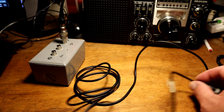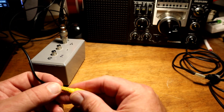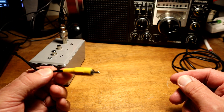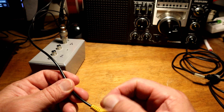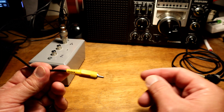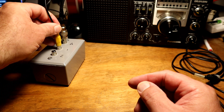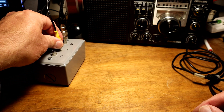That's one way that I do it. I also have — for radios like this which don't have a jack but have the two terminals — I just found an old video plug with an RCA end, and I just cut it off so that I had the two conductors: the braid and the center conductor. I can just wire that into my older portables and it does the same thing.